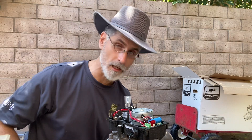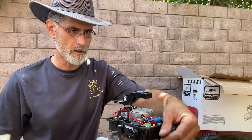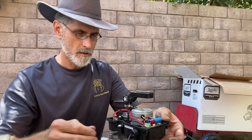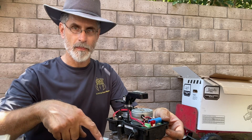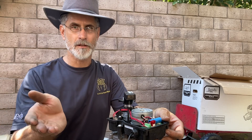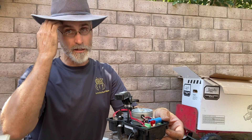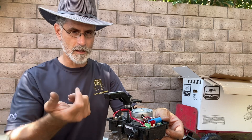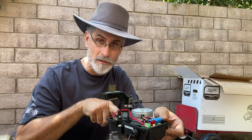The bottom cam is for the clockwise direction. So I want this to stop in the middle right now, and over here in the other position. This will be the default position — it always starts out to fall to 180 degrees, but I want it to only turn 90 degrees right now. So I'm going to turn it to this position, and see it's turning clockwise, so that should be the bottom cam — and the bottom cam has it stopped.